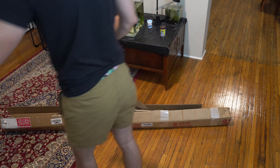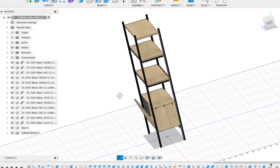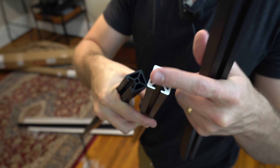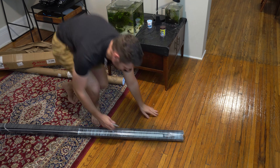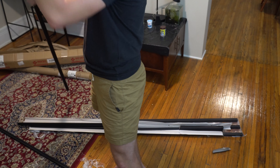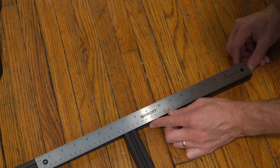All of the metal frame parts for this shelf came from a company called 8020. Their website allowed me to download CAD files for each piece I was going to use, so I could test it out beforehand in CAD, rearrange things, and make sure the look was exactly what I wanted. As you can see by the ends of the aluminum extrusions, not all of them have the same profile — that's so I can have a nice, clean, smooth look where I want it and also have the T-slots where I want them for attaching hardware. I needed to reference some of the plans I had made in my CAD file. I have a ruler here too, making sure that everything on the ground is matching what I planned beforehand.